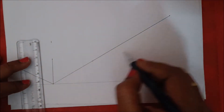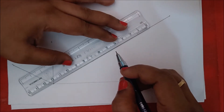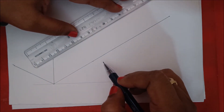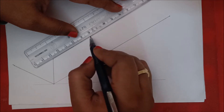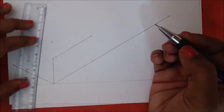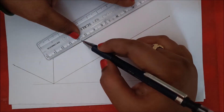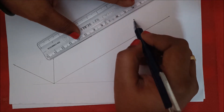On the 150 mm line at the top side, divide it into 50, 50, 50 equal parts. Draw parallel lines at this point, marking 5 centimeters — 1, 2, 3, 4, 5. Mark up to 8, keeping lines parallel. In this 150 mm you should draw 50, 50, 50 divisions, as it is a half lap joint and the middle portion should be removed.